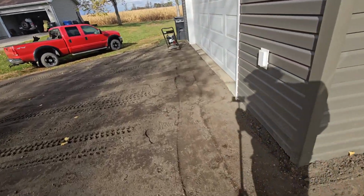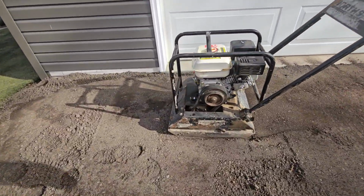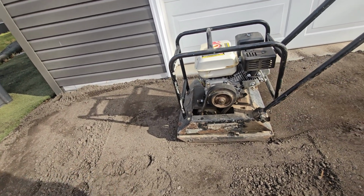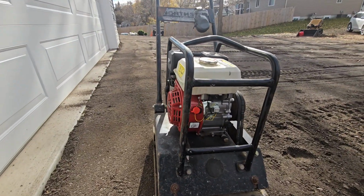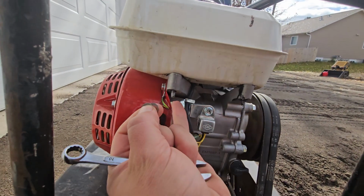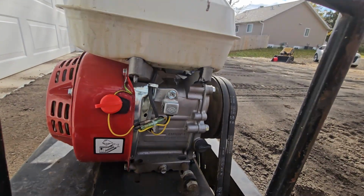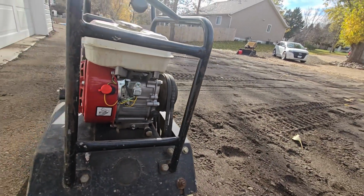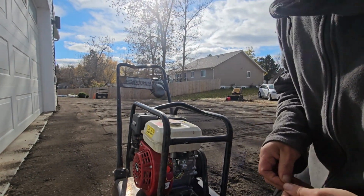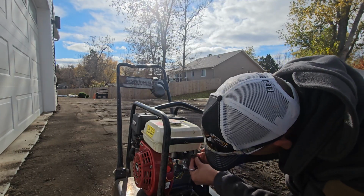One thing I'm noticing on that packer with that Chinese engine, that gas can is really shaking on there. I'm going to see if there's a bolt or something missing. All right, pretty minor. Much like this Chinese stuff all the time. These two bolts came loose, and you can see how loose that was. I seen that thing just flopping all over. Heck yeah, well, at least I caught it. I'm going to go ahead and put some nylocks and washers on that. And I guess a guy wouldn't even really notice that until you're actually working on it, but certainly can't have that tank.